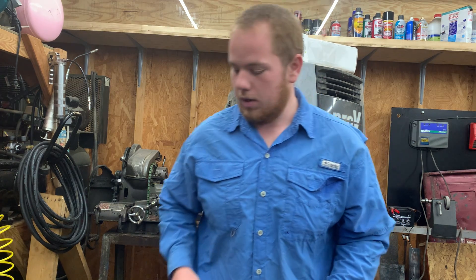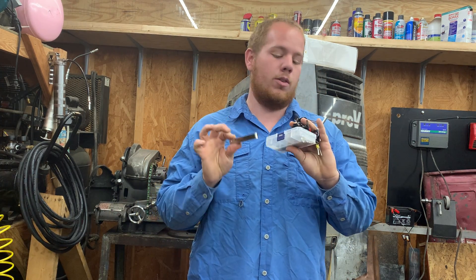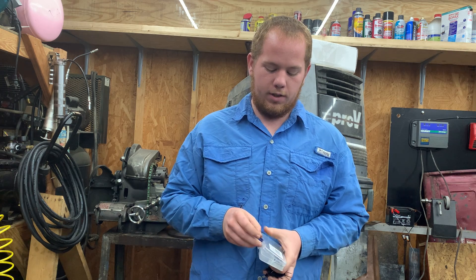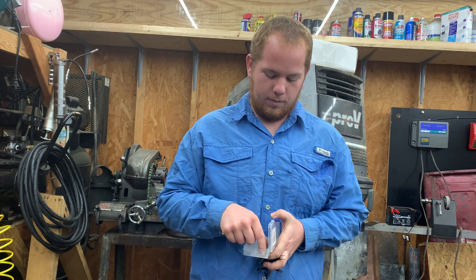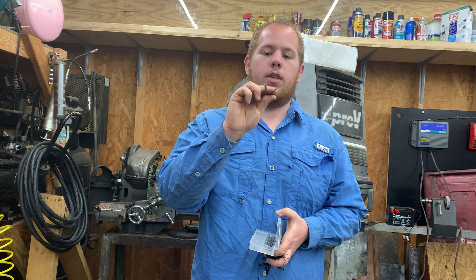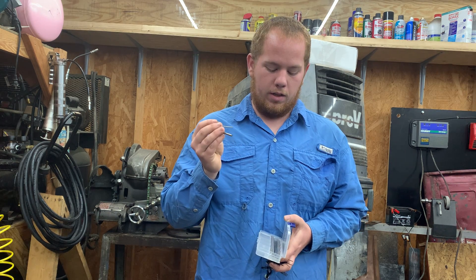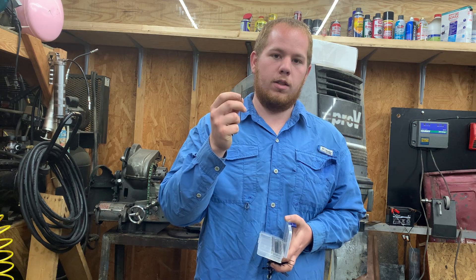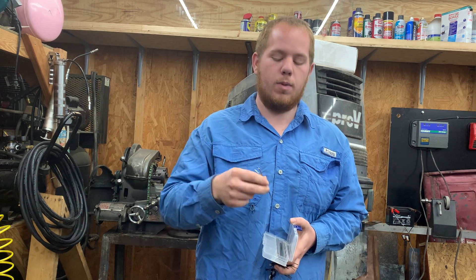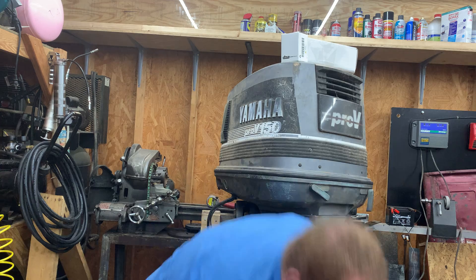The highly recommended products start with these extremely basic items. What's in my hand is about $15 worth of tools. These are stainless steel rods of different sizes — I think they go down to 3/32 or maybe 1/16. I use them for hole sizing or hole gauging. I use my calipers to take a measurement, then stick the rod in the hole. If it's too big or too small, I go bigger or smaller, then measure the rod once I find the right fit.